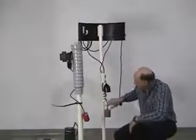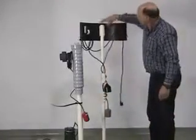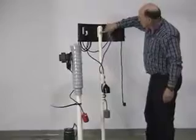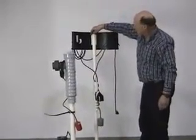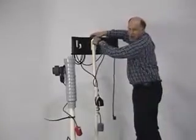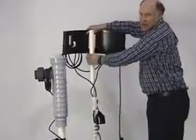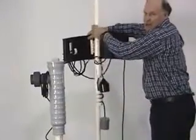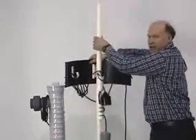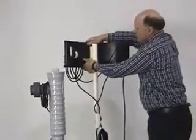You just simply cut this piece of pipe just short of the top of the riser. We do like to see this pipe stick out of the bracket a half inch or an inch or so, so you can actually grab onto this pipe to remove the float tree. And this whole float tree can actually come out of your tank and can be snapped back in to this bracket again, holding it in a vertical position.